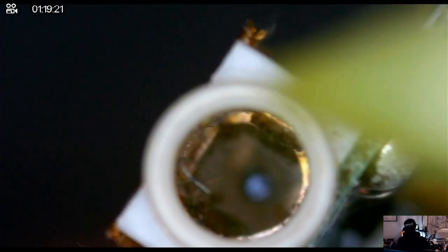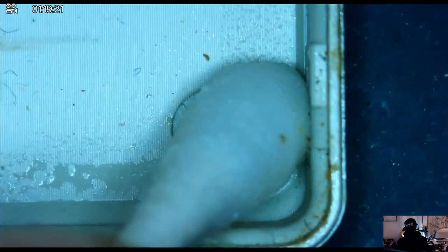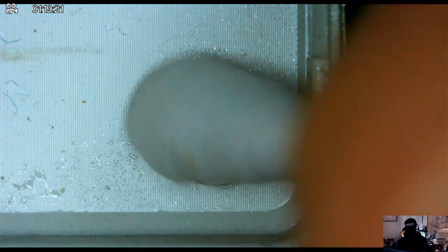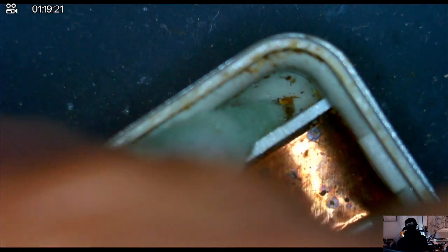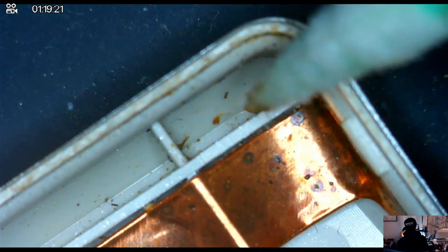Here I want to make sure the optical drive also has some sort of cleaning procedure done with it, so I did that here as well. Now we're getting to the main board — I don't want to use rubbing alcohol on this portion because plastics don't behave the same way as PCB and metals. So I'm using just warm water and soap, rubbing it in with a little elbow grease to try and get off the sandy-like detritus. Here I'm using the cone cotton swab to really get at these harder edges.